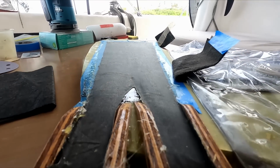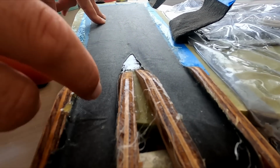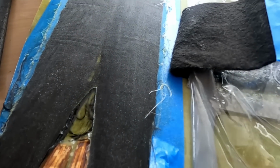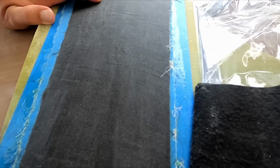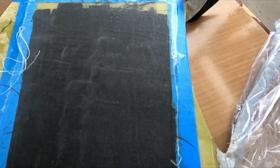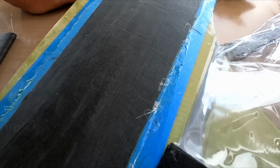I spent a lot of time in a research and development lab testing stuff like this, and the nylon peel plies all have silicon release agents on them so that you can actually get them off. It basically produces a resin-rich surface for you to sand, and when you sand it, it shatters the resin matrix at the surface, which then gives you a good surface to bond to. But the straight peel-plied surface by itself is not good to bond to.